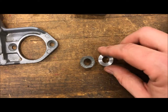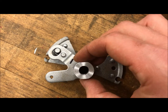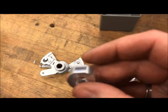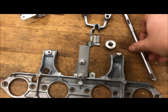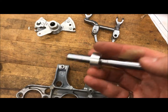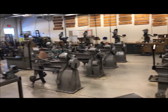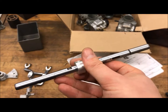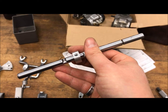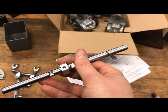Threads are all cut. So here's the old one and here's the new one — when I measured the flats I made it just like that one, and you can see when I set them on top of each other they're the same. We've got our flats on there, the drilled and tapped hole, and it should all fit onto this shaft like this. That's the beauty of having a machining background — when something's not right you measure it up and manufacture a new one. I hope you guys enjoyed the video and I'll start putting this thing together and post more videos as we continue working on these carburetors. Thanks for watching.